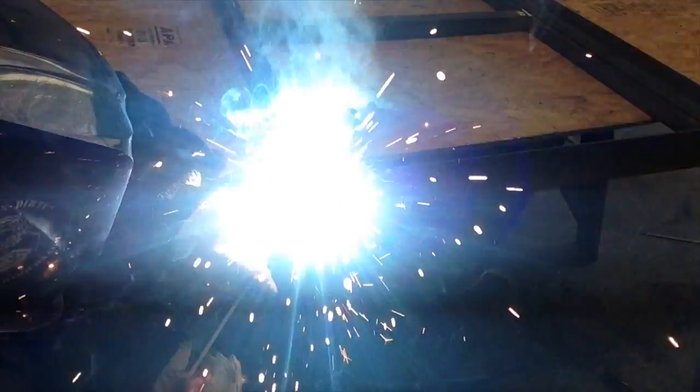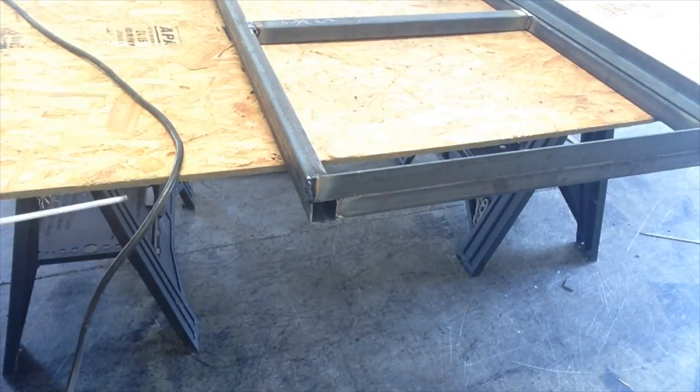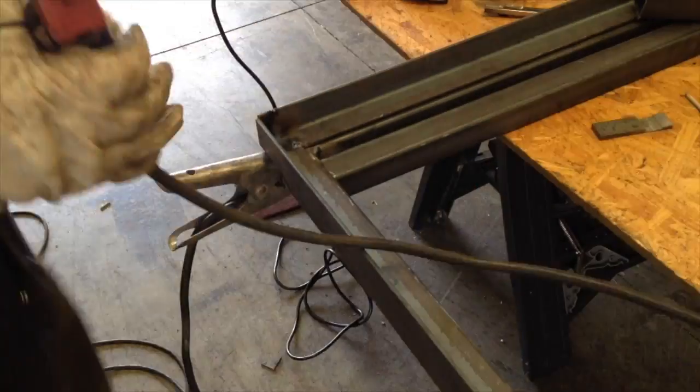There's an outside corner joint — I'm going to slow it down here and show you that again. Same clip as before. Somewhere around 110 to 120 amps, just keeping a nice tight arc and keeping that rod pushed up in there — use the arc force to push the slag, keep it back behind the puddle — and it works out really well for stuff like that. That's why I like it for little fabrication jobs like this.